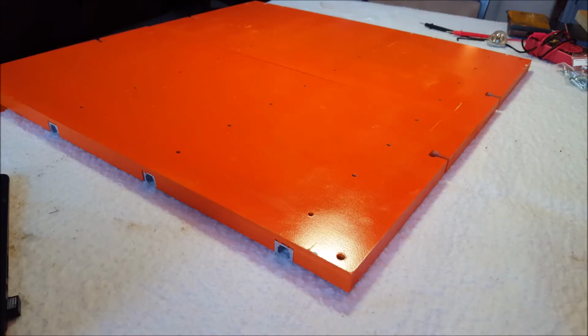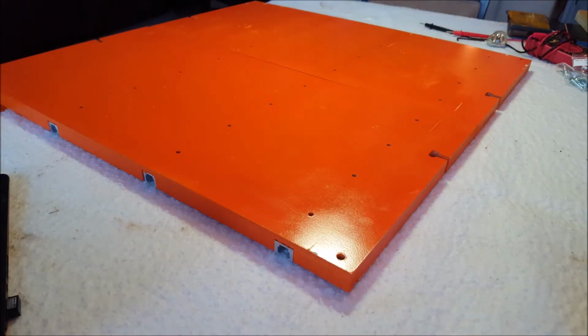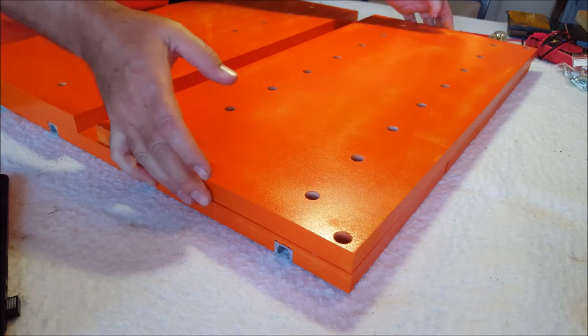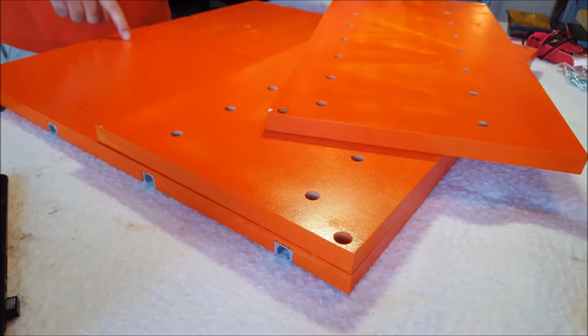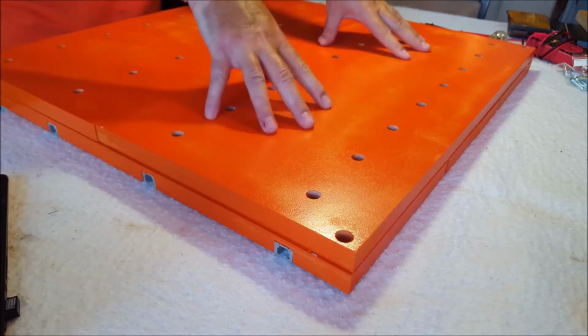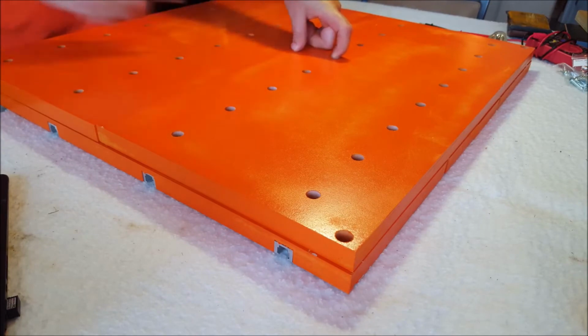Now the instructions say after putting them in, flip these boards over, and what I did was I put my indicator hole right here, and that keeps the bottom or the front to the front. And it says to place the base, I think that's what they call it, the same way with the indicator hole as you had it a little while ago. That same indicator hole is right here that matches the indicator hole that's right here, except for these of course are crossed. And then you know you have that orientation correct, and on the top board you know you have it correct because of the two corner holes. Now of course the board out holes go up.